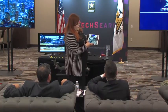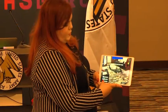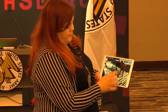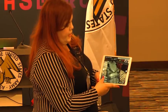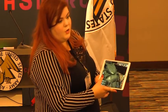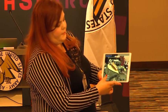the aircraft, which you can track, you can rotate, you can increase the visibility of the entire electrical system or reduce it if you want. And you can also, when you scan, it's reading the clamps. And as it's reading the clamps, it's gathering all this data. And if there's a problem within the augmented reality system, which is also applicable in HoloLens, where the mechanics can actually go there and be troubleshooted, it can tell you, hey, there's a problem here. You can see which system it is. You can go in and see the system in high fidelity.